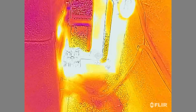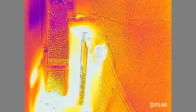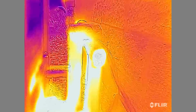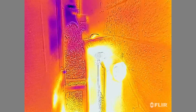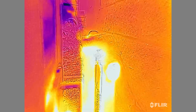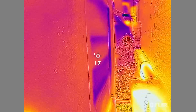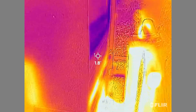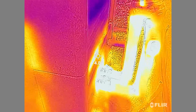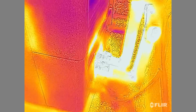They didn't lag around the connectors here, and that's usually because they want good access to isolate if they have to. The insulation Octopus use is quite sticky and we don't want it getting in the way if we have to isolate or change the Cozy 6 in an emergency. Some installs I've seen are better lagged, and there are specialist pre-made foam pieces for going around isolators, but these are more expensive and labor-intensive, which passes costs on to the customer.